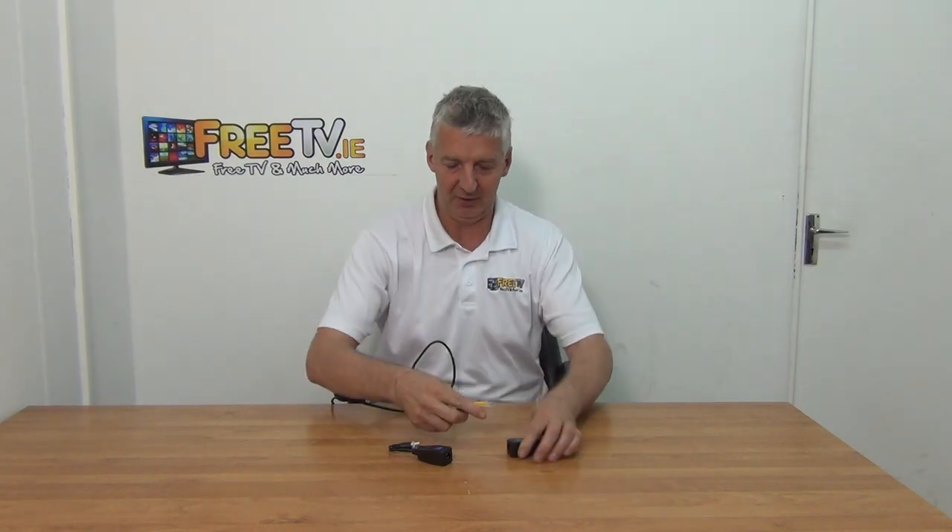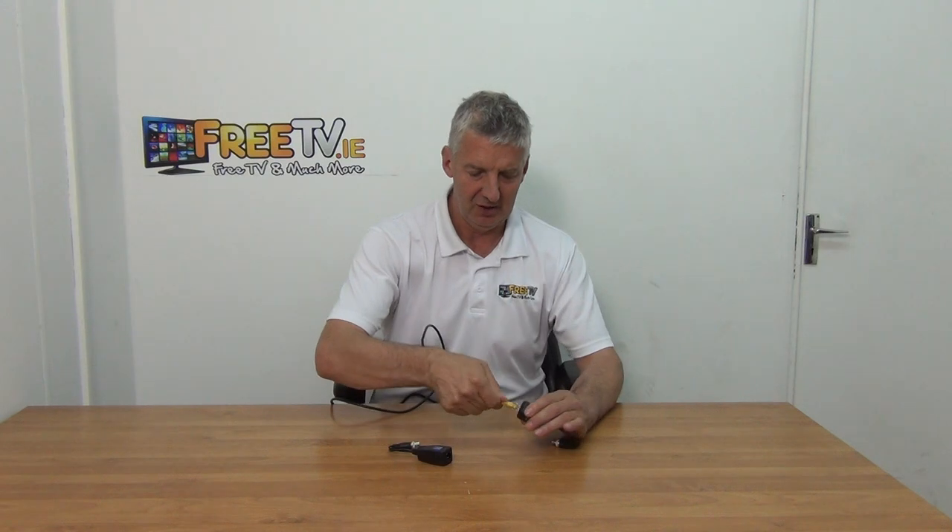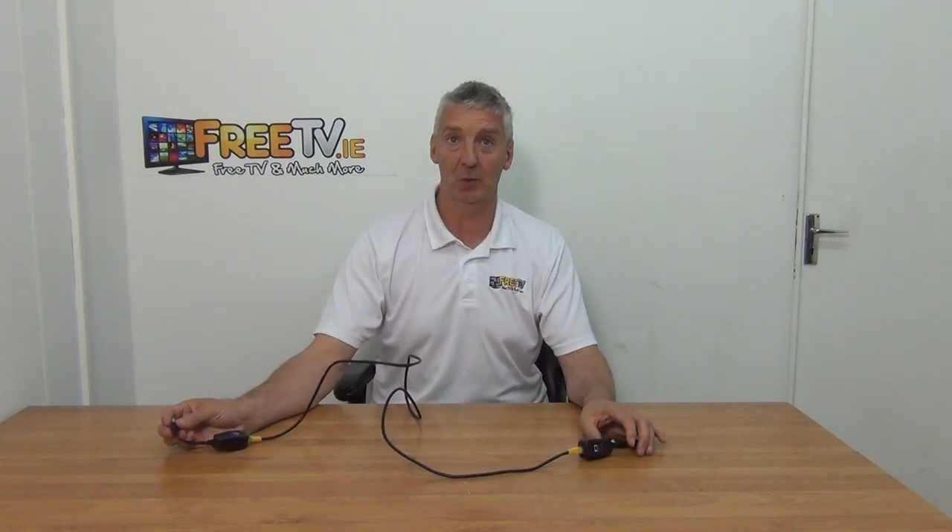If you're using technology like this, you can support anything up to about two megapixel, up to about a hundred meters over an ethernet cable. So what's happening here is you have your camera connected, the power supporting it there, and - let's pretend this is a 50 meter ethernet cable - same technology, just push it in here, push it in the far side, then connect it into a power unit or power coming directly off the DVR, and all of a sudden power goes over and powers the camera and the picture comes back.